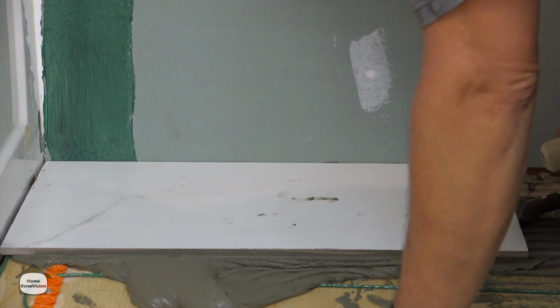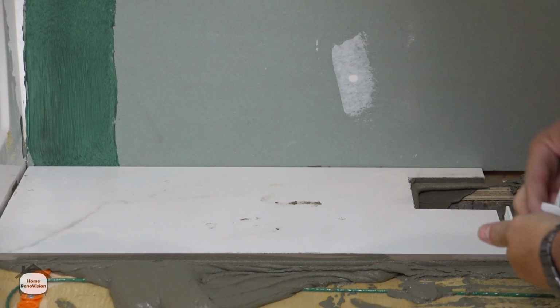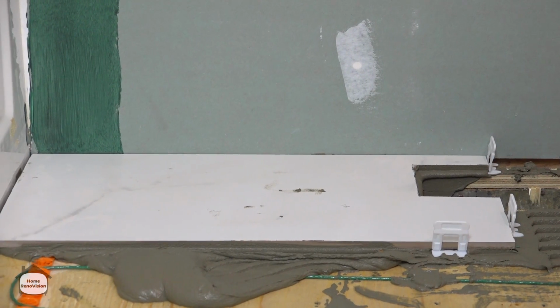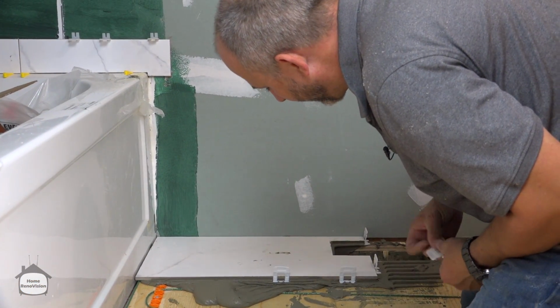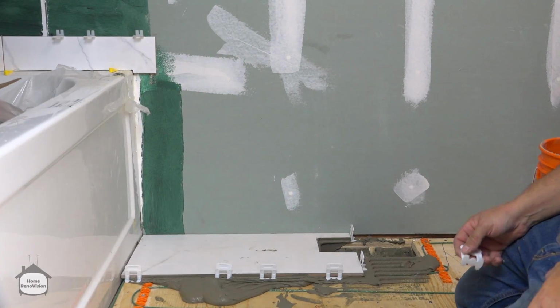So when you're installing your heating system, just clean away from the tile. Put your leveling clip underneath. It's that easy. Okay. Now we're going with a 1/2 offset, which means I'm going to have a grout line here. So I have a tile that starts on each side of that grout line. And then I'm going to want one over here as well. That's it. That's set up and ready to go for the next tile.